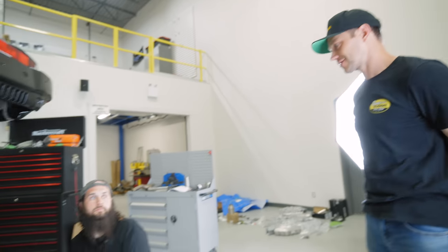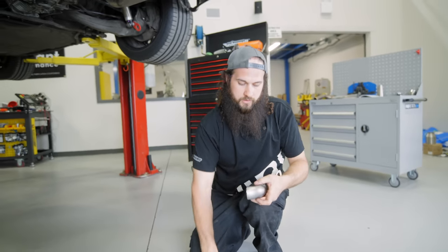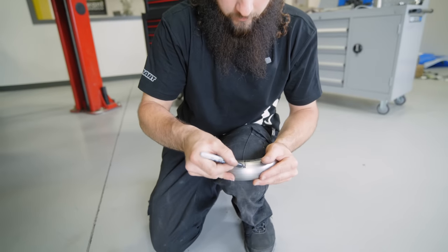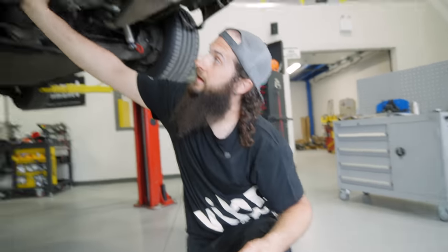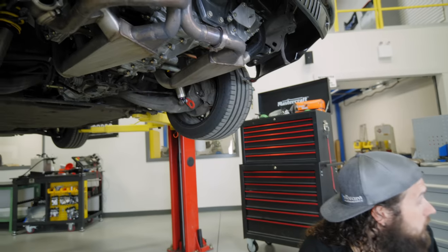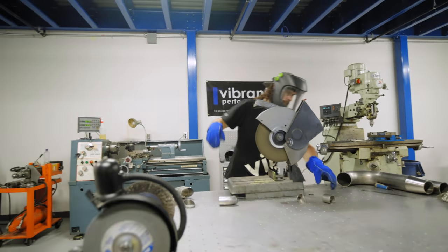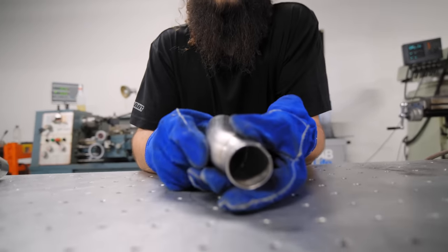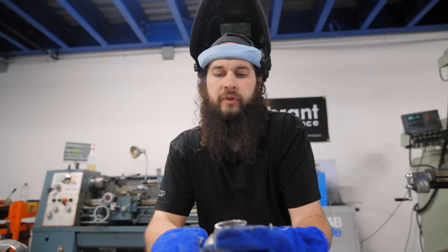Right, right. So I'm going to cut this guy. We're gonna cut him here in the middle, and then we'll flip it around, and then this will be our little kick that we need to come over with. I'll tack those onto this, and then we'll come back. We've cut our 90 degree bend, cut it at 45, and then this is what's gonna allow us to get over to where that exhaust pipe fits best.